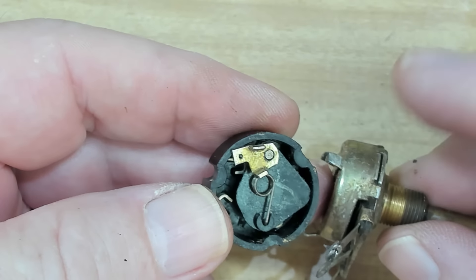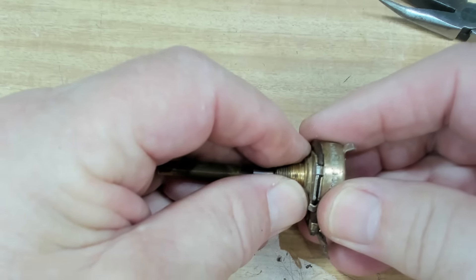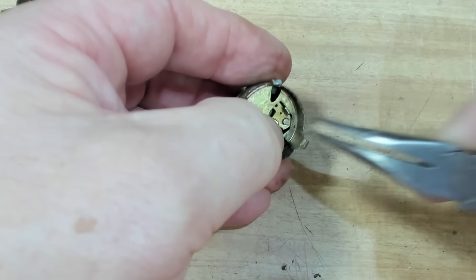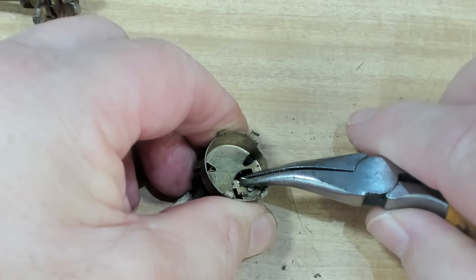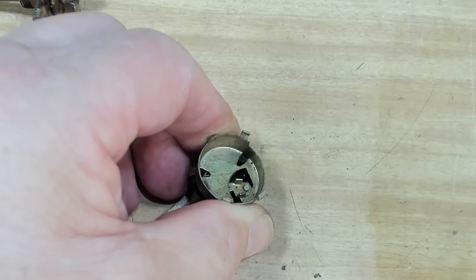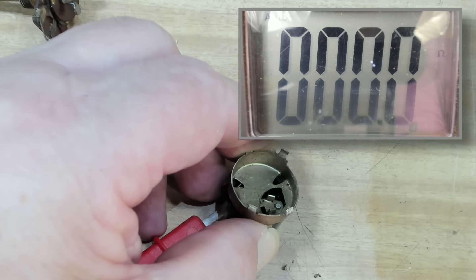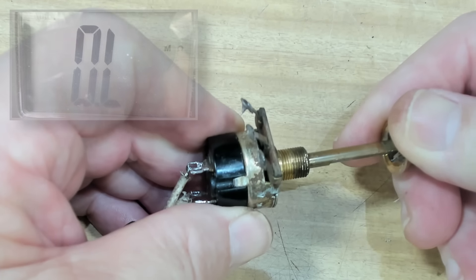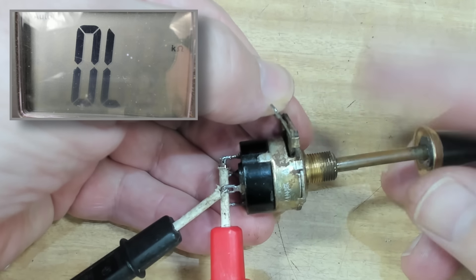I'll try and get that in - and this is where I was having trouble, trying to get that in there. There we go, and now it'll work. I've connected the meter and I'll just operate the switch - make sure we've got zeros. That one's working. I'll change the leads over to the other contacts - open, close. So that's done. I'll put it back together and we'll test the radio again. It's all back together - I better check it before I put it back in the radio. That one's working, and I'll try the other connectors as well. Good. I'll refit it.